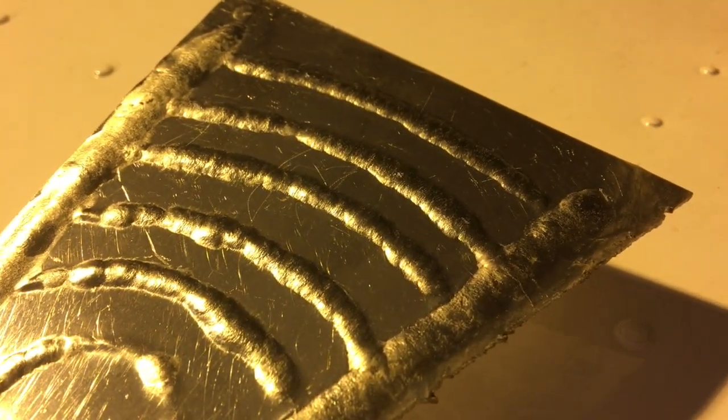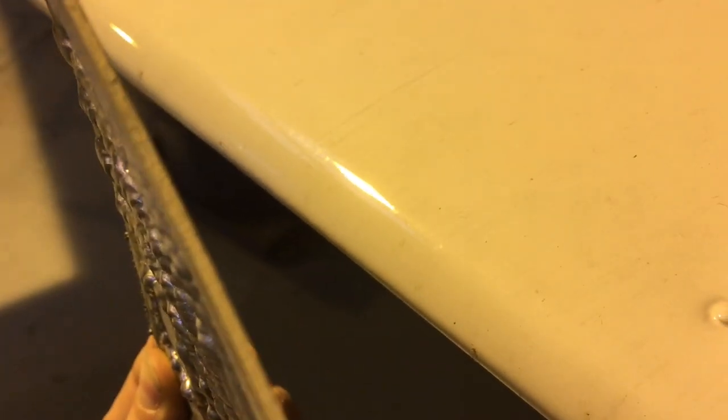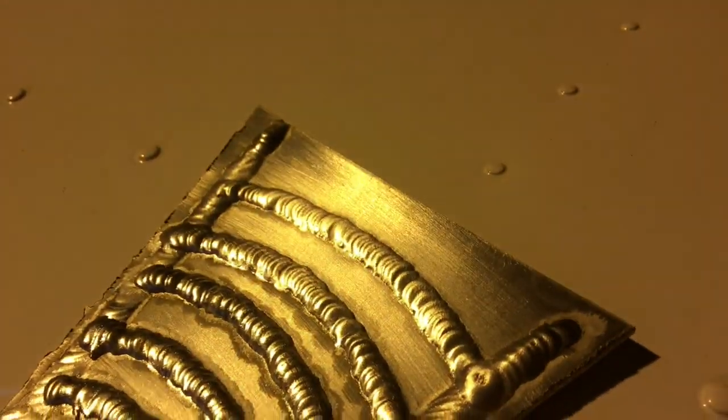But this is a thin bit of aluminium — it's 3/32nd I think, so it was always going to penetrate. That's never going to be a problem. So a few more hours, and that's the thing to do: get a piece of aluminium, grab yourself a rod — it's cheap. You can weld over and over and over. You can dunk it in water when it gets too hot and carry on. You can put bead on bead on bead. It never gets difficult. Hope you've enjoyed. Thanks for watching. Good night.